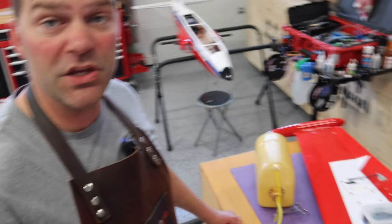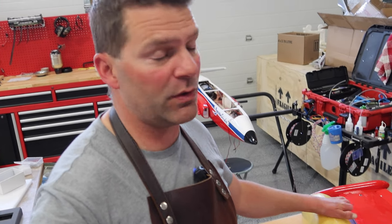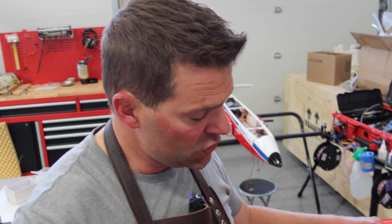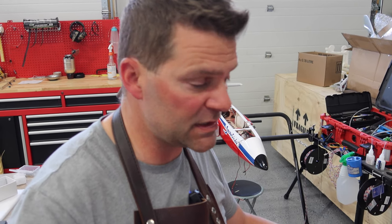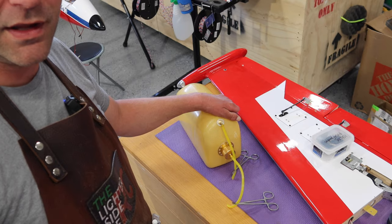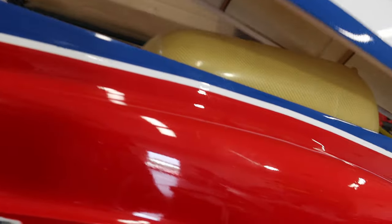Now what you do is come back to this in an hour or eight hours - this is a great way to do it if you have time. If you don't have time, do the same thing without clamping it off, but hold this tank underwater. If there is a leak you'll see the air bubbles coming out and you can deal with it. All we do now is come back in about an hour - if we undo these clamps and air comes out, then we're good.